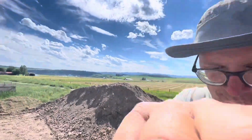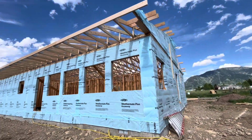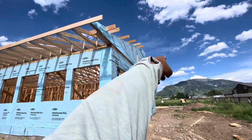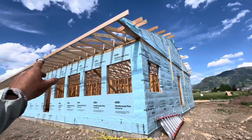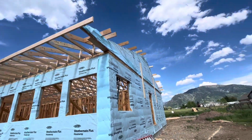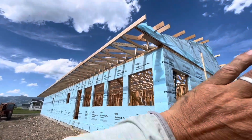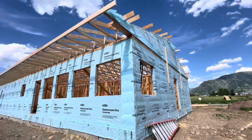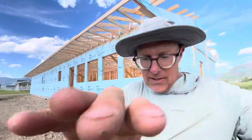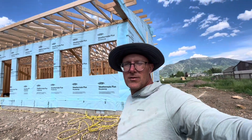All right, we got one whole side, the fascia board up, and we put the outriggers up, except for the two at the very peak on each end because they're pretty high. We're going to use the lift to do that. First thing in the morning, we'll run 2 16-footers up towards the peak, one on each end, and then we'll start sheeting and hopefully sheet up and over the top tomorrow, and then finish up Thursday. Fingers crossed. I'm already exhausted. Can't wait till Thursday's over.